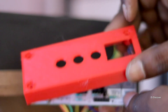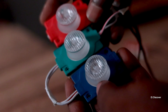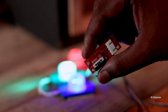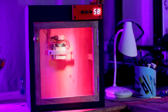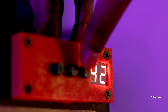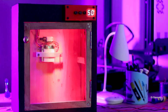You can see the 3D printed case. I covered the board and tightened it with screws. To run the dry box I am using a 2A SMPS power supply. I also added a light and door lock system — when I press the switch, two lights turn on and one is always on. I attached this system to the wooden frame along with a door switch. On first boot there was no smoke, and the display is showing the current humidity. The present humidity is 72%, so I set the target to 45%, which is good for the camera. After 10 minutes, the dry box's humidity went down to 45% — it is working very well.